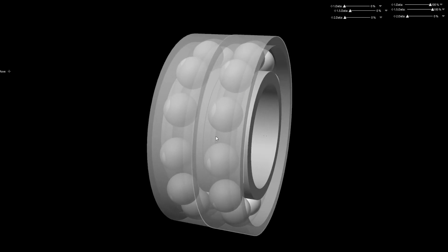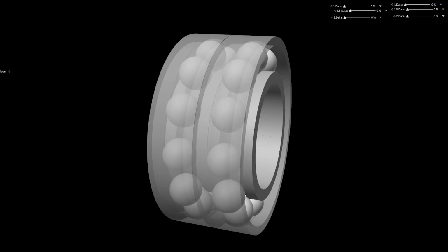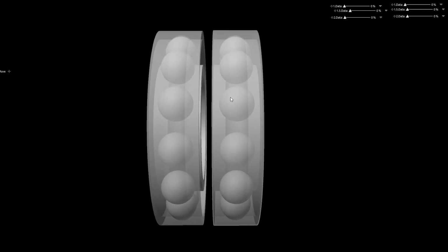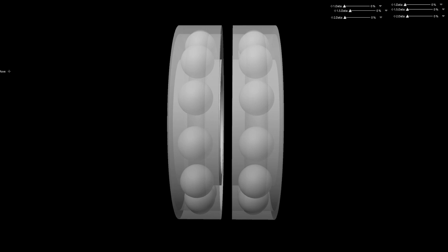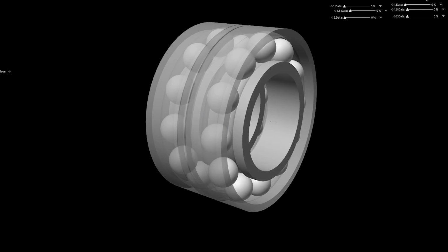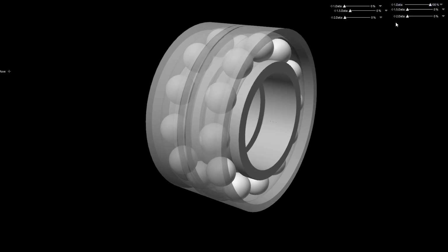So what we need to do is actually separate those ball bearings slightly. So we need to move them apart slightly. So we would place the second ball bearing with a slight gap, or we would add a spacer in between them, and we would then preload them against each other. So we would compress one race one way and the other race the other way.